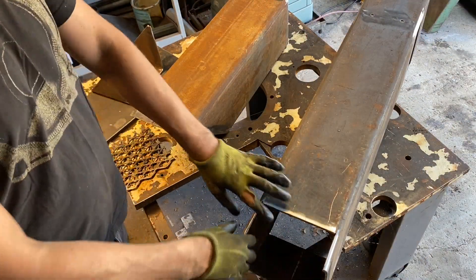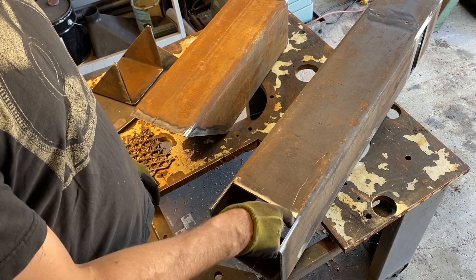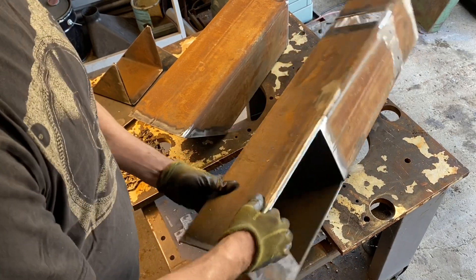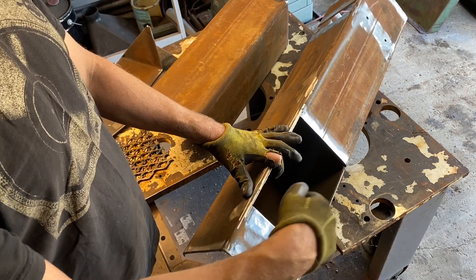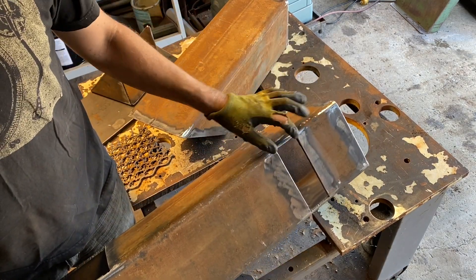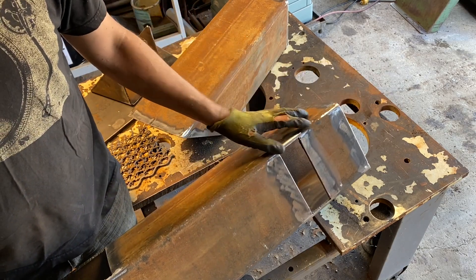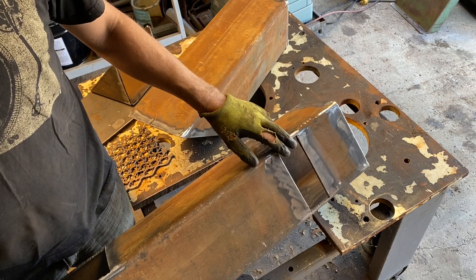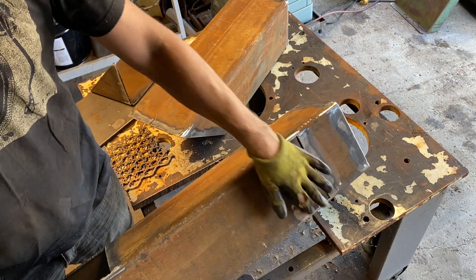I have all my pieces cut up and sanded where I'm going to be welding. This is the cutout for the air intake. This is the part that we put on the 45-degree angle tube that's going to feed our wood into — and this is both sides. I cut out a two-by-seven-inch cutout, and this is going to be the stack for when we close the valves to redirect the heat and exhaust through the two exhaust ducts we're going to put on this section here.